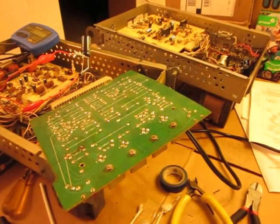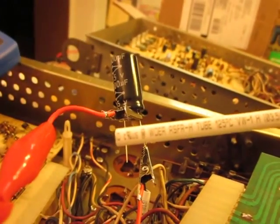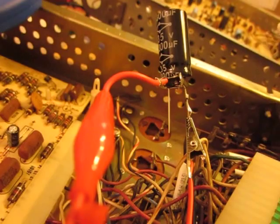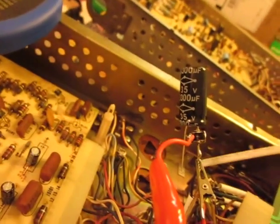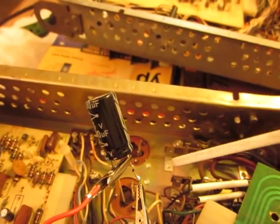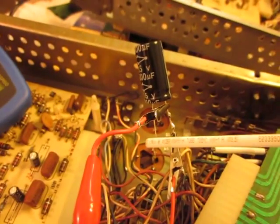I hope that helps you if you're a novice at doing this like I am. So now I've soldered one of the legs — the negative — onto my new capacitor. I'm using heat shrink tubing; I put it on there ahead of time. I cut about an inch and a half piece of it and stuck it down. Once this solder joint is done, I can slide the tubing up and use a hair dryer to shrink it in place — there will be no exposed wire to short out this very large, important capacitor. Because the old capacitors are physically riveted in, I'm just going to leave the old ones sitting on top and not mess with them, since removing them would leave a big hole in the amp. I'm only cutting one lead at a time to make sure I do not get my polarity mixed up. I'm going to be doing the positive next.